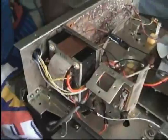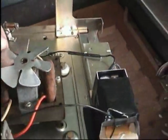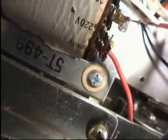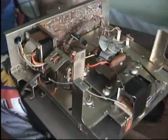This transformer here has to stay in, because it powers the motor. This motor is 110 volts, and the transformer has many different taps for the international voltages. But I've hardwired it so it's connected to the 240 volt, which is the voltage used here. Let's plug in and see if it all works.